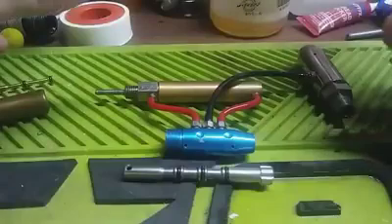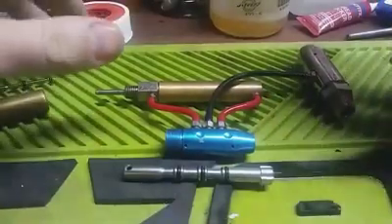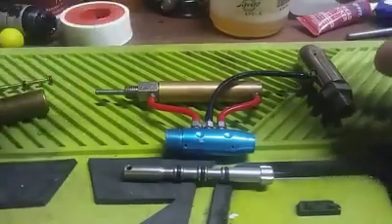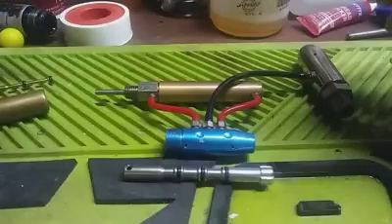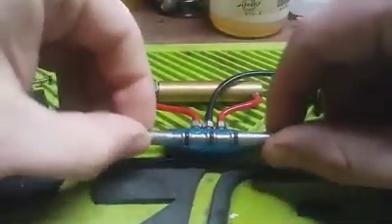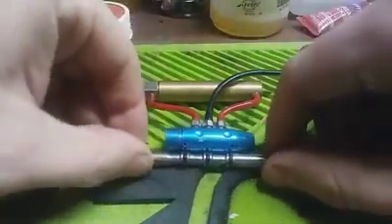That's pretty much all that's going on on your front block — that's how pretty much all of them work together. Even when we get to solenoids, a solenoid is essentially just a small electrically operated three-way. All it's doing is the same thing: shifting air one way or another to cycle that ram. So that's kind of the basics.